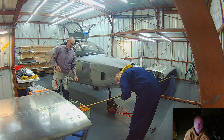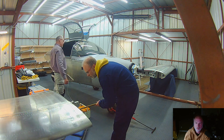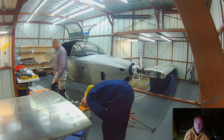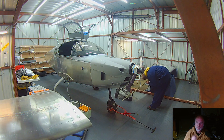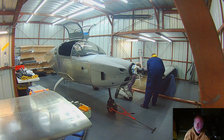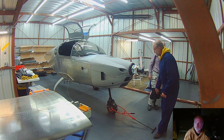Just to be sure we were exactly where we needed to be, we went ahead and test-screwed it on to confirm it was there. You can change the bolt on the other end all day long, so as long as it fits going into the fuselage you're fine, even if you're incorrect on the outboard side. Then it's just a matter of getting it inserted through the eyelets in the ribs in the wing. There are access ports on the bottom of the wing that let you reach inside to guide it through those bushings.